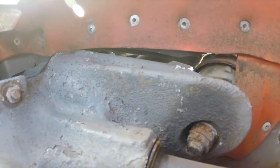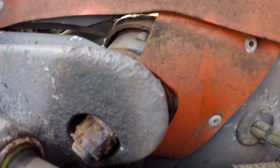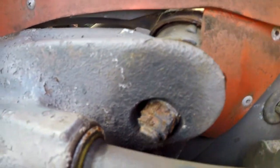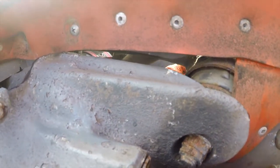Like on the other side, none of the under cylinder baffle slots have been tied together. So a real lot of spilling air is coming off of this engine. Check your airplane — you really want to have these right to make sure that you get good cooling.